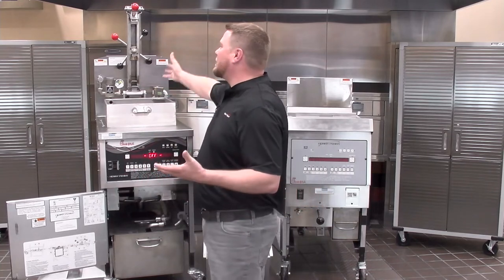We covered a couple of items for filtration troubleshooting, but let's talk about some items we can do at the store level to help save on pressure-related issues. Some of the pressure-related issues you could come across are: the fryer not building pressure, building too much pressure, leaking around the lid while cooking, taking too long to release pressure at the end of the cook cycle, or the volcano effect where you have oil and water coming out the stack at the back of the unit while cooking. These are all common problems that, if we don't take proactive measures, could lead to costly service calls. Let's talk about the first one — the unit not building pressure when you're cooking.